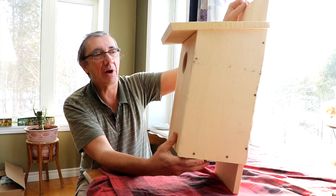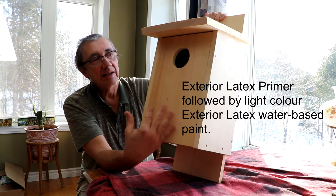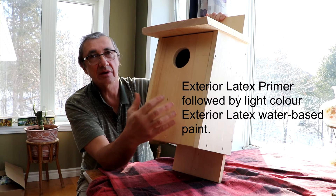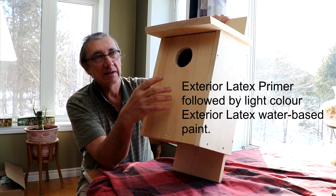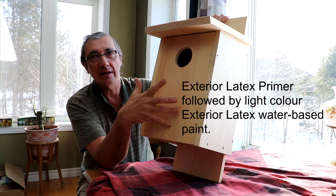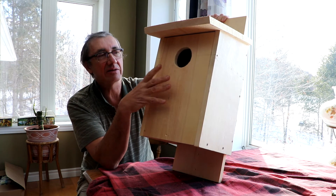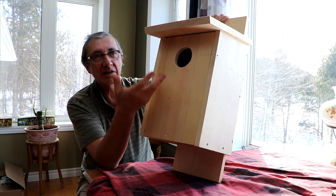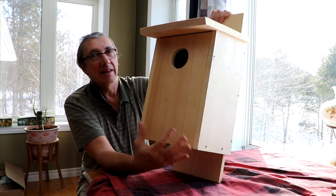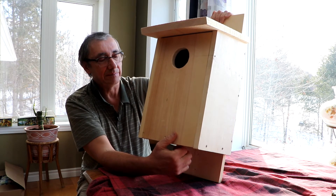In the end I'll probably paint this. You can leave it natural — paint does provide protection for sure. If you leave it natural, it'll turn gray in about a year, and then the sun and rain will tend to start creating cracking in the soft pine wood. It looks nice for a while and retains itself for a while, but eventually the cracks expand with winter thawing and freezing. Paint gives it a few more years of life for sure.